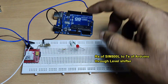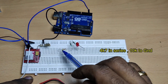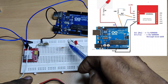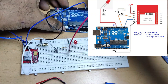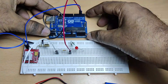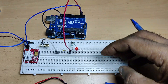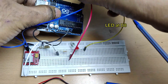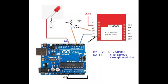As there is a voltage level difference — the SIM800L tolerates only up to 3.7 to 4.3 volts — we'll be using a level shifter: a series 4.7kΩ resistor and a 10kΩ resistor across it. Through that resistor divider we'll connect RX of SIM800L to TX of Arduino Uno. We are also connecting an LED at D8 of Arduino Uno, which we are going to control from the Blynk app. This is the final connection.